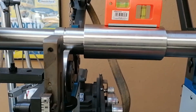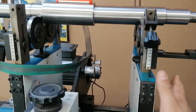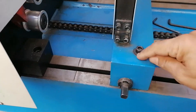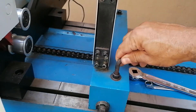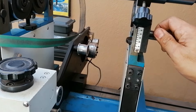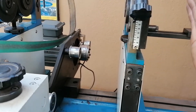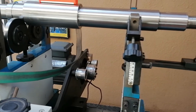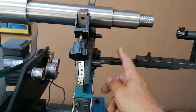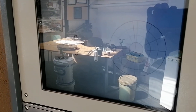I'll check the distance between the two posts — that looks okay. Once you've shifted the posts to the desired positions, you must lock them using a ratchet spanner down here and an Allen key to prevent any vibration. Make sure all those things are locked so nothing moves. As you put the weight of the impeller on, you might need to adjust because of the weight on this side. I'm also going to remove this component that's in the way, since the impeller sits here on the shaft. The machine is also on and we're almost ready.